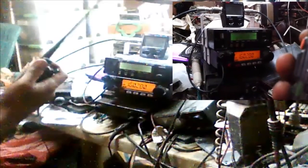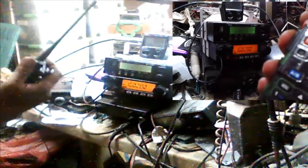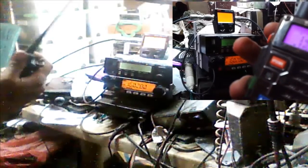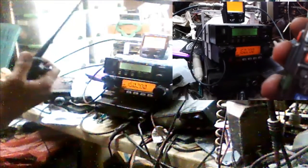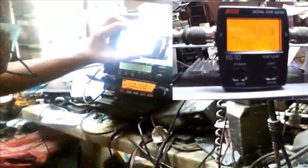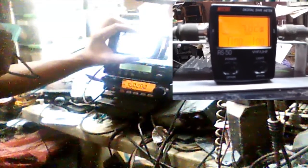I will not show you the frequency, but you will see the transmit indicator. Before that, we will look at the TX power output to verify there is no more intermittent transmission. Setting is low — that is low power. The power output is 4.82 watts with no reflected power and an SWR of flat 1:1 on the dummy load.